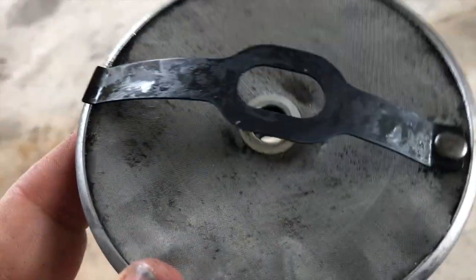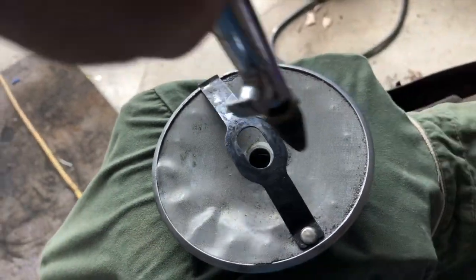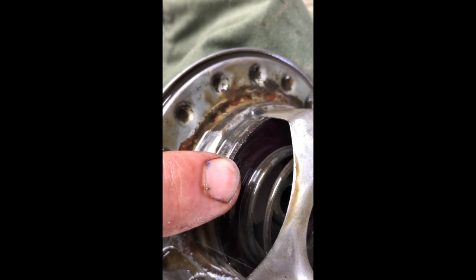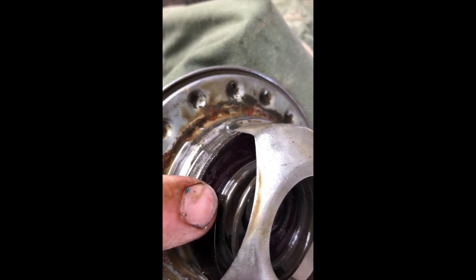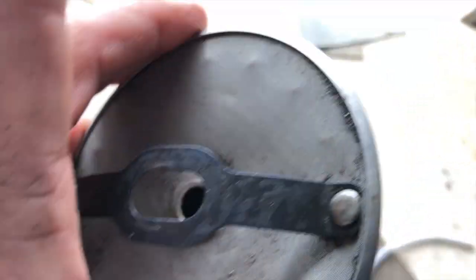The screen is almost completely clean. This is a check valve that holds the fluid that's already passed through in the system when you turn the tractor off. It will keep everything that's already been pumped in the system from draining back into the reservoir when you shut off. So let's go put this humdinger back on.